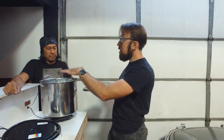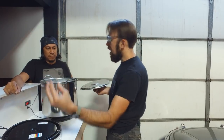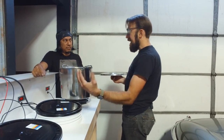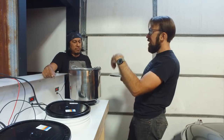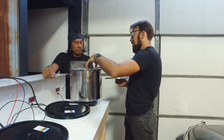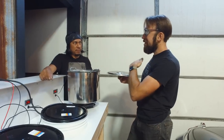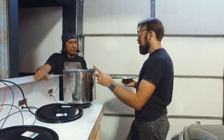And this is a sealant. So once we get the honeycomb oxide layer built up in the sulfuric acid, then we get the dye, which penetrates into all those honeycombs. Last, it goes into this sealant, which seals the whole thing and kind of caps it all off. How long does it sit in here for? This one's like 15 minutes.